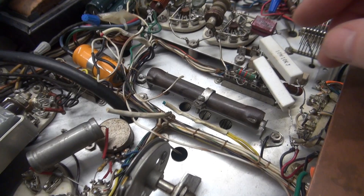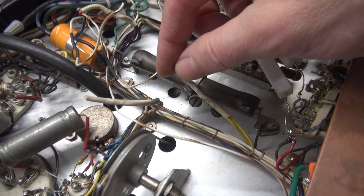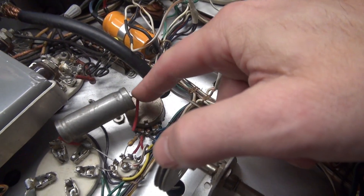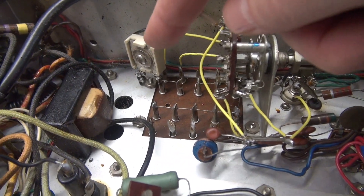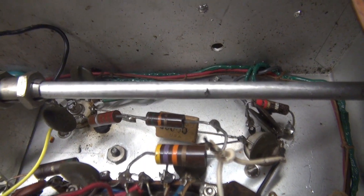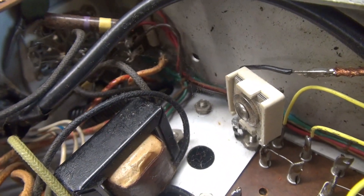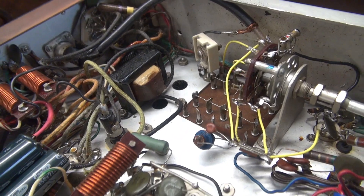It's my favorite transmitter. The stock resistor is back where it should be. These two yellow wires that were extended go here; these go to the slide, and the two purple ones go to this end of the resistor. I also notice that this cap broke loose — doesn't matter, I'm going to change it anyway. There has been some magic going on in the VFO area; looks like somebody was trimming something. I also just noticed some cooked wiring — see that green wire? It's been baking. There's a gigantic bubble in the insulation. Obviously at one time some wiring to the VFO must have been shorted and baked that wire. So I've got my work cut out for me.